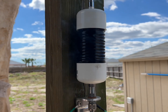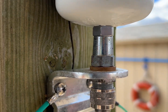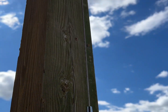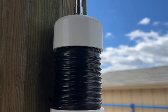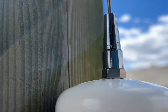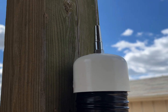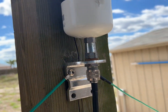So we got it on a two-inch PVC pipe. On the bottom we have a 3/8 by 24 stud that goes into the mount. The whip came off of a Tram antenna from what I can tell, because I do have the pieces of the bottom — I just don't have any of the wires. This stud is actually a 5/16 by 24, so the top is 5/16 by 24, which will eventually go to 3/8 by 24 when I get the actual whip that goes on top. The bottom is 3/8 by 24.